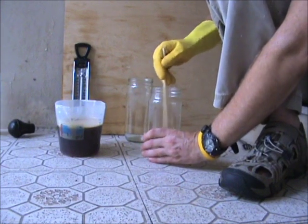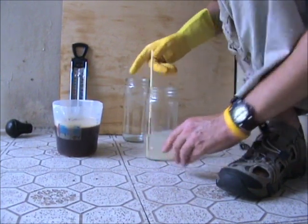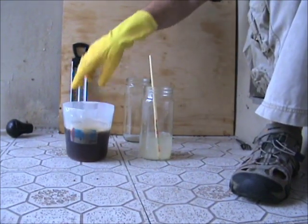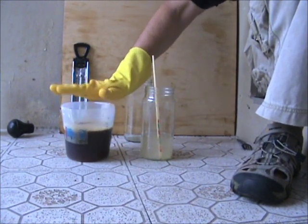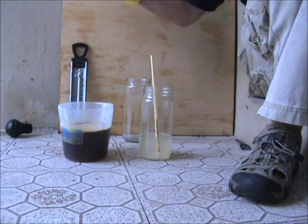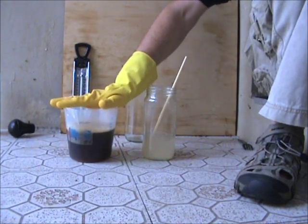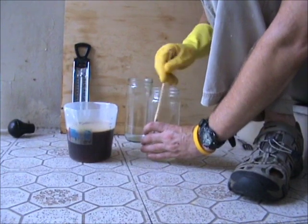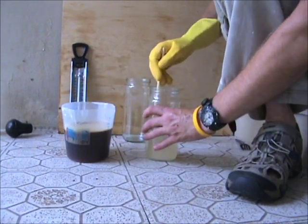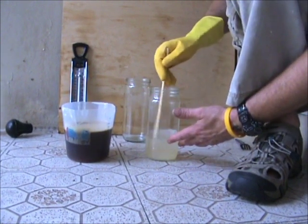That's reacting nicely. I've also heated the oil up. When it comes to mixing the ingredients together, I'll get the oil up to about 60 degrees Celsius — no higher than that. If you go higher than that when you introduce the methoxide, you'll get a reaction with bits splattering all over the place. The methoxide will also get up to about 50 to 60 degrees Celsius, so when you introduce the two, there's no temperature reaction and no spillages.